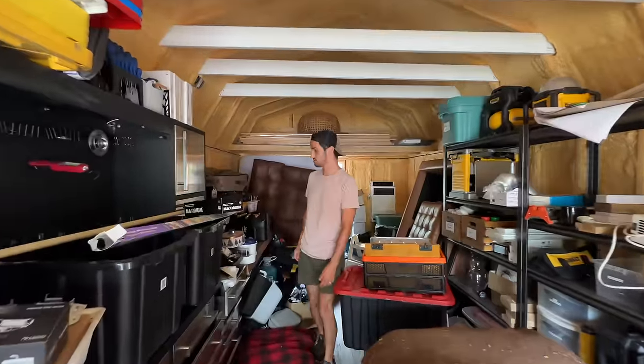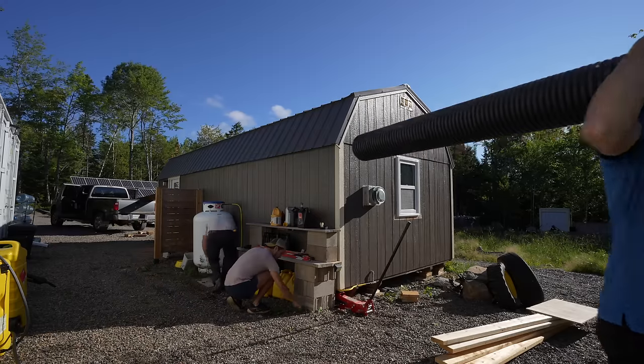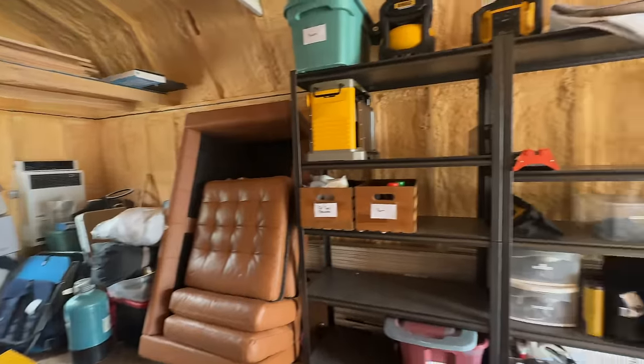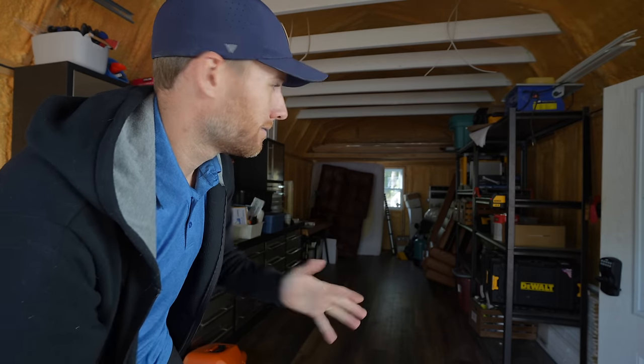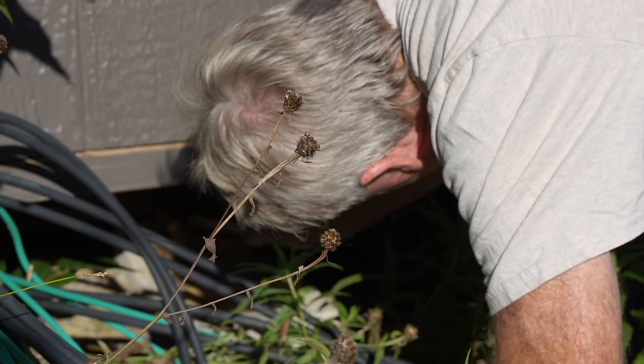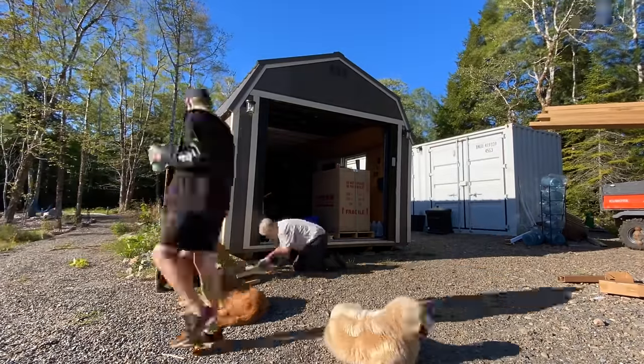Where do we start? We've got everything pushed against the walls right now. I think we'll move everything into the center and start tackling everything. But first — the building is very unlevel. Right there we are 23 and a quarter inches, so we're down four inches. We noticed because we put a piece of tape on the floor and it just rolled all the way back. We need to jack the building and level it up because there's literally no point in finishing it — if we do, everything will just crack and shift. So let's figure it out.